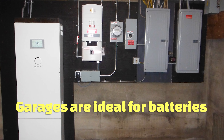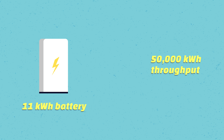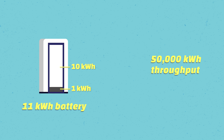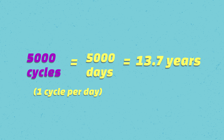You can make a battery last longer if you keep it at the right temperature. The PV system battery warranty document is a good guide for how long the battery will last, because they normally also give you what's called a throughput power. For example, an 11 kilowatt hour battery with a warranty stating 50,000 kilowatt hours of throughput, charged at 10 kilowatt hours per day, gives 5,000 cycles — which works out to around 13.7 years that battery is warranted to last.